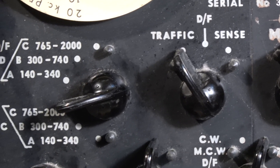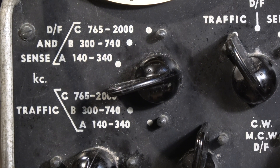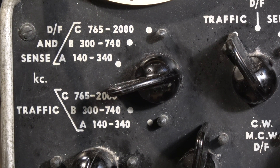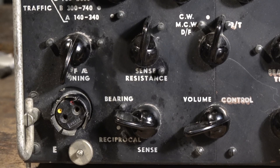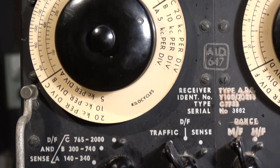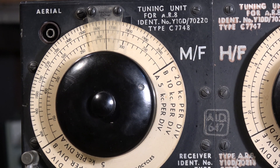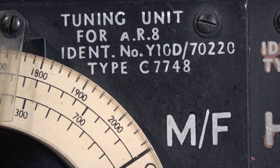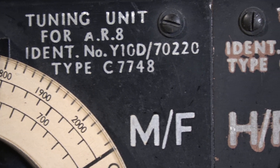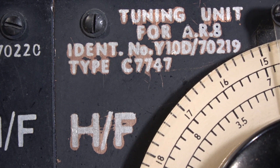The IF frequency is 755 kilohertz, and the broadcast band is divided in two with a little gap in the middle, so you can't listen to 3LO on 774 kilohertz — not that you'd want to these days. The reason for having two separate front ends for high and low frequencies was to ensure optimum performance of the circuits. Also it allowed you to have preset channels on both bands, and you could switch between them.